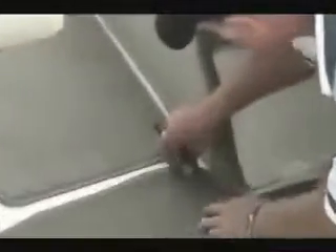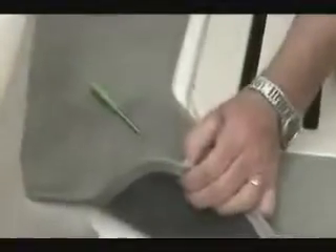We've chosen to start in the main cabin area in the high traffic zone of this boat for the carpet installation. Starting here, we're going to identify each of the male snap locations in the deck, mark that with a marker, and then install the snap. We found it's easier to put a hole through the backing with a tool — I'm simply using a Phillips head screwdriver. From your marked location for the snap, poke the hole in, then take the cap part of the snap with the long barrel on it, put it through the hole, and get ready to install it.